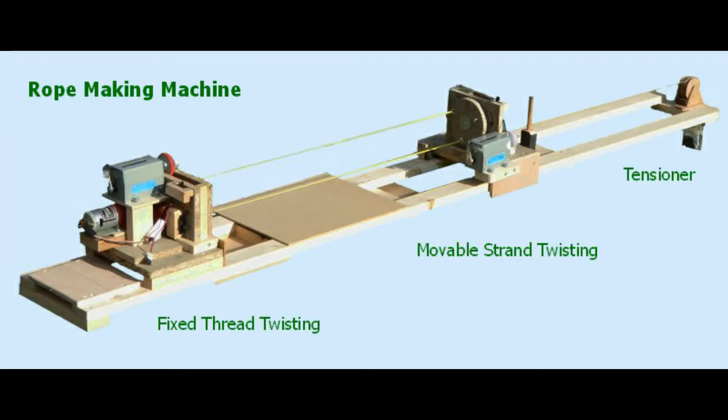This is the complete rope walk. The left hand end is fixed and the right hand moves on a trolley along the wooden base. The trolley runs on four bearings and is positioned by side pieces over the base. A cord is attached to the back of the trolley, running over a pulley at the end of the base down to a 150 gram weight to tension the cord during twisting.